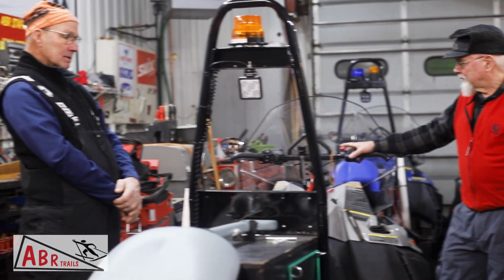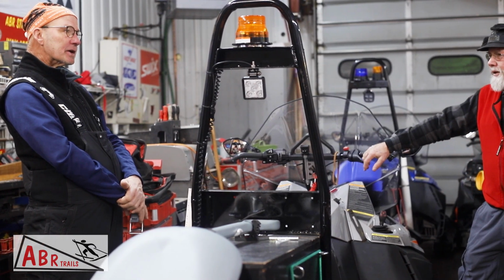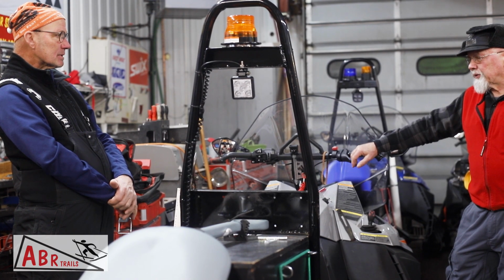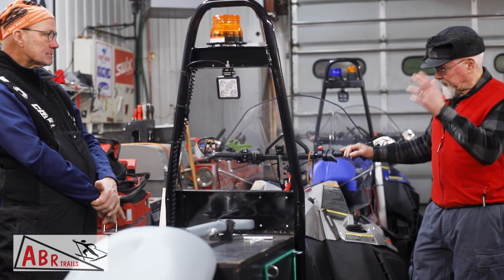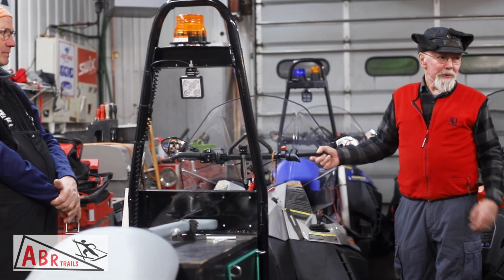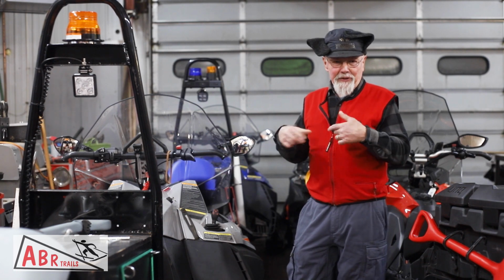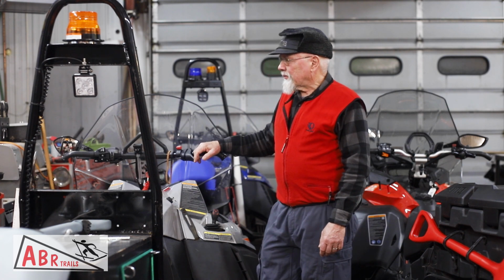That's really important. We have had one sled where the guy got ejected into the ditch and he couldn't shut it off. That one was sitting upside down for quite a while, and some oil leaked from the crankcase up past the rings and into the combustion chamber, and it hydrolocked. You put liquid in a combustion chamber and it's not supposed to be there. Liquid's non-compressible. So they had to pull the spark plugs out, crank it over, put the plugs back in, and then it started up. Yeah, just get to the kill switch as quick as you can.